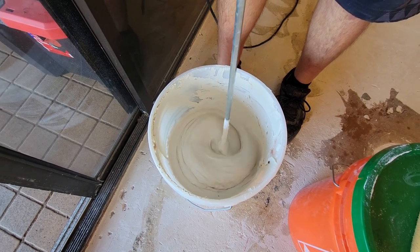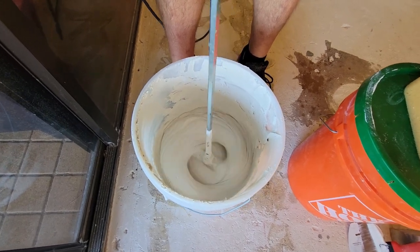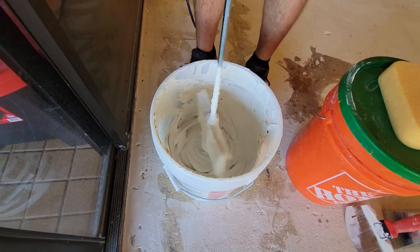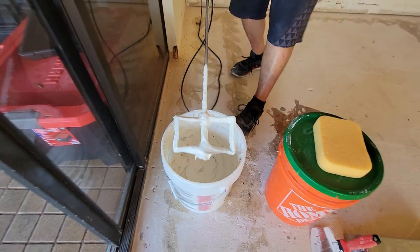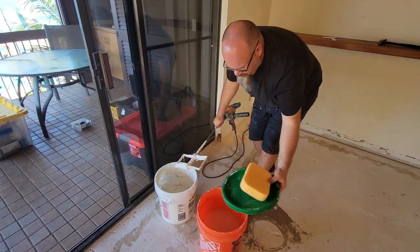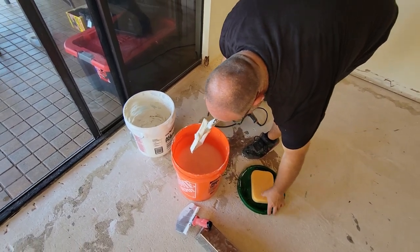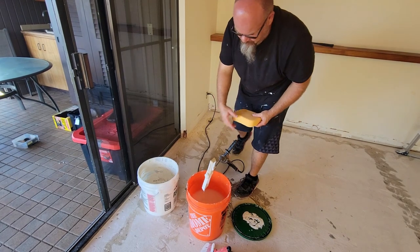That's key — you want clean mud. If you pick up dust and dirt and debris from the ground and trowel it, you're going to get little chunky bits in your wall that are going to cause you a fit. I do the bottom where the baseboards are going to go very last, after the rest of the walls have had a little bit of time to set up. This is the consistency I like. I whip the paddle in my water bucket, tap it off, and then set it in the bucket.